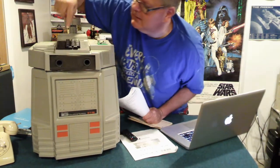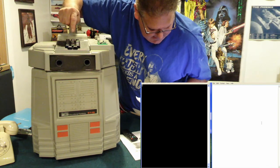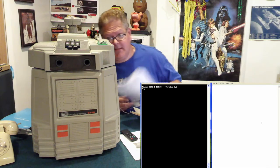If you don't have the instruction manual for BASIC, contact therobotworkshop.com. Robert over there, I'm sure, will help you out. To get BASIC running, we're going to do a command. It's called a cold start. We got them powered up, and we're going to do 1D on Hero. So 1DA 000, 000. And that gets his BASIC running. His BASIC is now running.